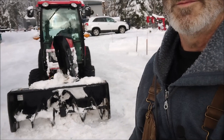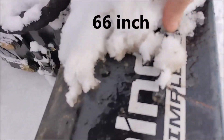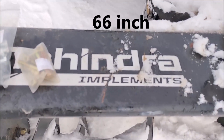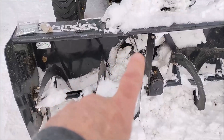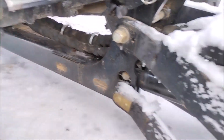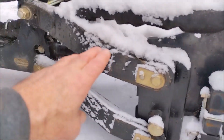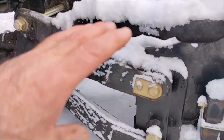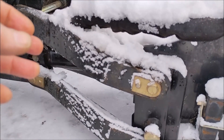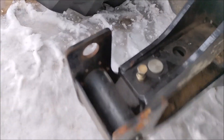When I got right down towards the end of the day, the blower just stopped throwing snow. On this Mahindra 2638 I do go through quite a few shear pins. The shear pins on the blower are obviously made to break so you don't damage anything. There are two different shear pins on this — let me show you. This is the Mahindra 60-inch implement. There's a subframe that mounts underneath your tractor. There's a pin on each side you can pull to take the head off and disconnect the hoses, which lets you keep the subframe on and put the loader back on.